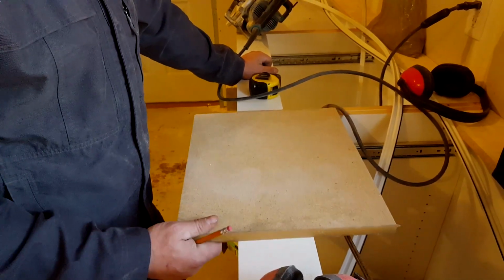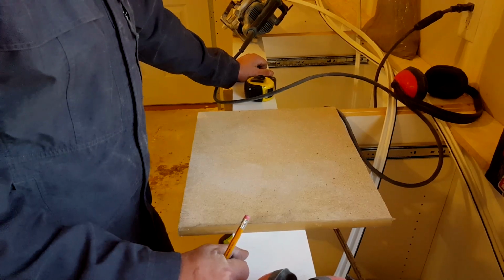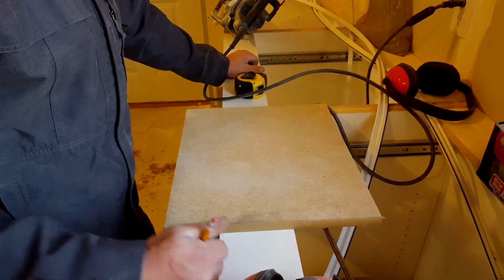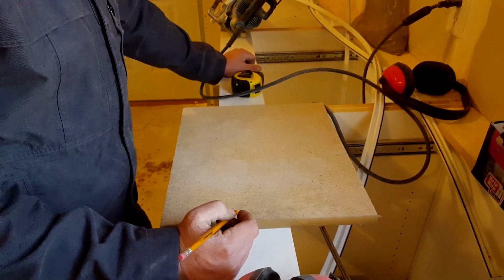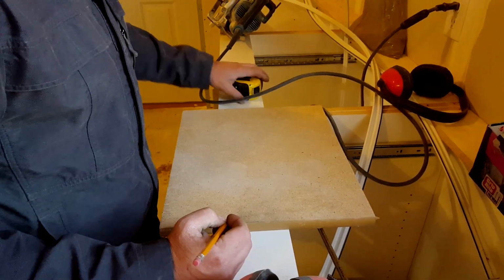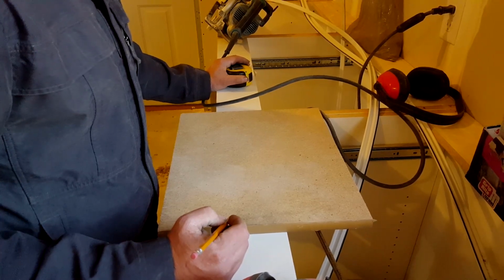Okay, I'm just building a couple stair stringers to go into my exterior doors on my house. They're kind of small ones, but I thought I'd just show an easy way of making some stair stringers. The first thing you want to do is just figure out how tall your total rise is. In my case, going from my garage floor to my house floor is 23.5 inches.